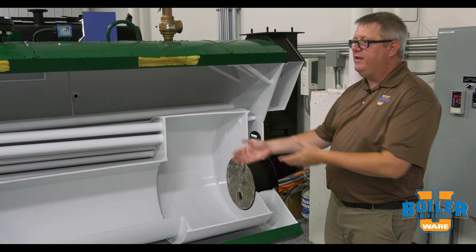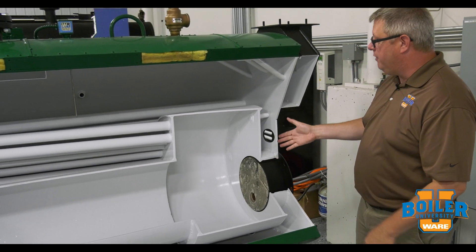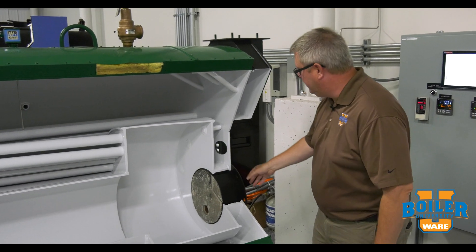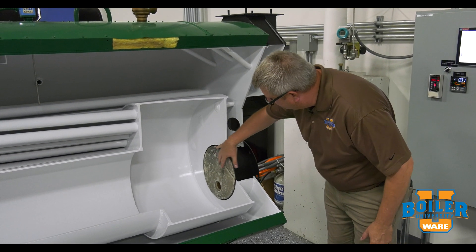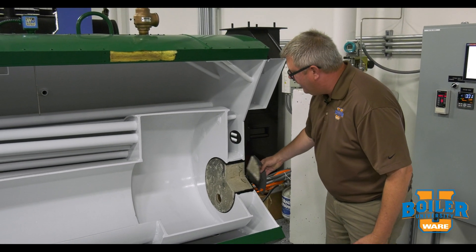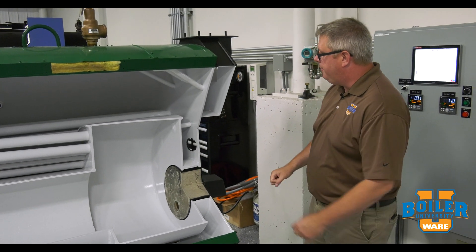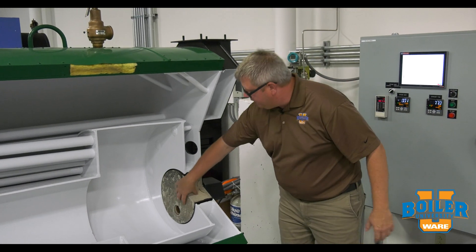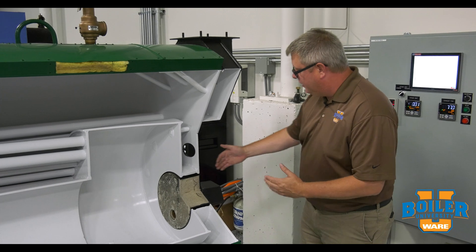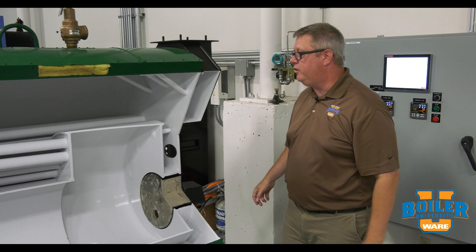When we're firing a boiler, we've got a lot of heat coming from a burner, and if we've got metal on the boiler that's not protected, a lot of times it'll be protected with refractory. In this case, we've got a refractory plug for access in and out of the boiler, and that's usually four to six inches thick with anchors. The reason that block is there is to keep heat from the flame from penetrating the metal and making a glowing red disc on the back of your boiler.